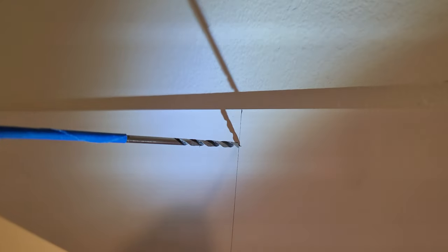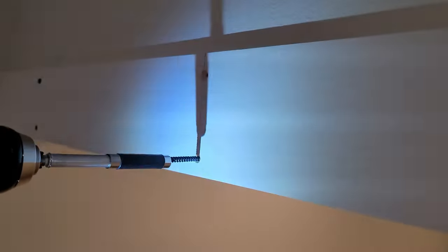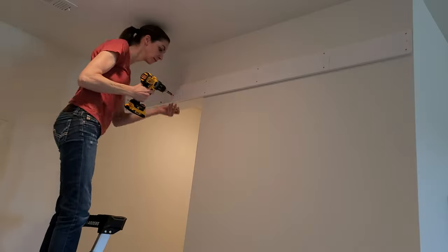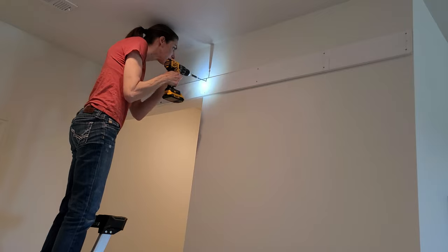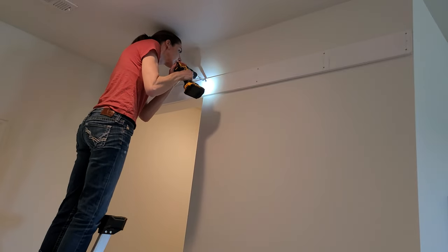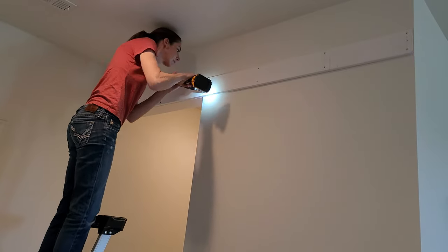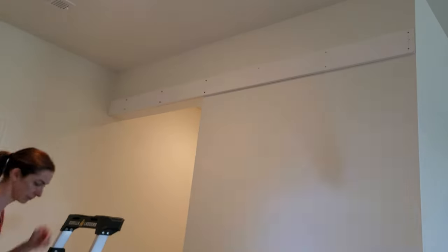Here is a close-up showing that I drill all the way to the edge of the painter's tape, then stop. Try to drill in as straight as possible, and then follow up with a three inch screw. For these three inch block screws, they're wood screws and they're self-drilling, but we still do the pilot hole just to make sure the header board doesn't crack or split.